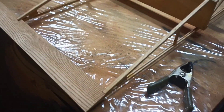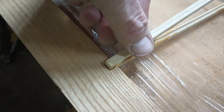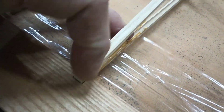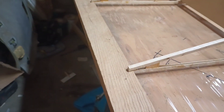At this point it's not important that everything is square, but that the joints are very solid. On the end here I can draw that one in real tight because I'm just pushing in against the side and drawing it in. I'll put a clamp from back here right across there — it'll also draw it in. Here I've got a nice tight joint, nice tight joint, nice tight joint. Not so tight right there — I'll need to put a shim in there, something that makes that very snug. I'll draw all of them in like this and make them even with the top.